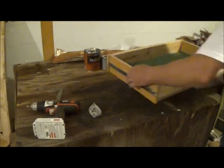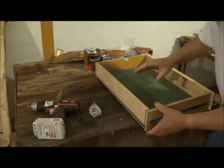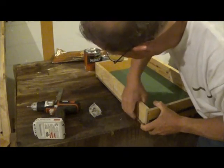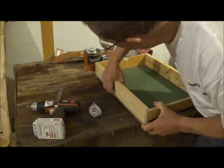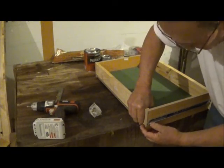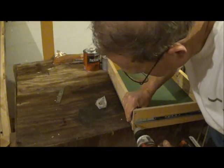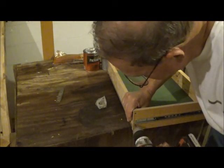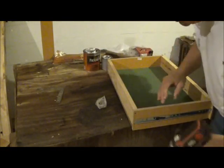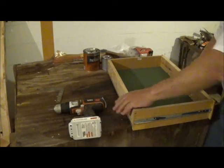Do the same here. Now the drawer is starting to become very stable indeed. You have just this one more edge to true up — kick in — so everything is solid. That pulled in very, very nicely. Now don't overdo it here; in the end you'll strip all your wood threads, and you don't want to do that.